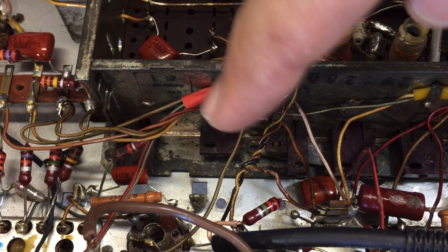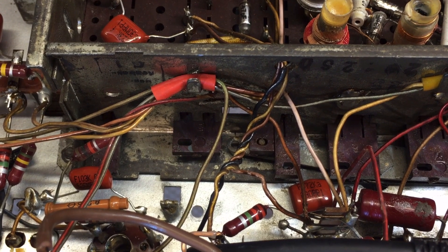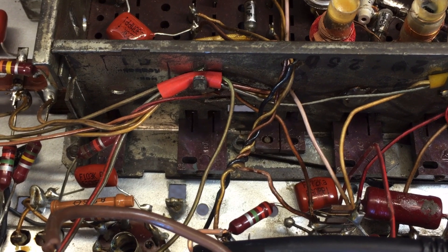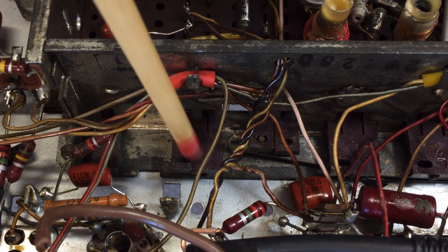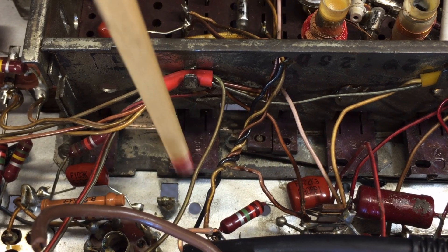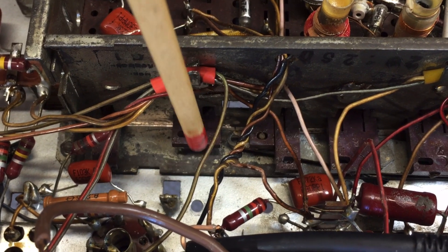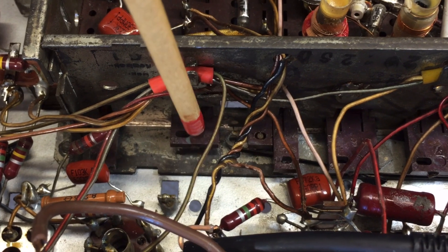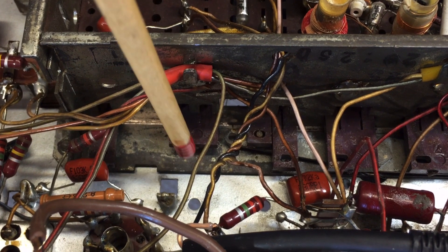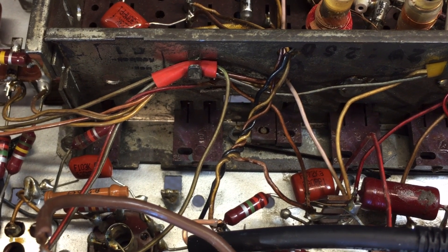If we look at the switching that happens at the back of the switch assembly, you'll notice something interesting. I've got the pickup selected and I deselect — select, deselect. Now if you look carefully, you see that guy over there? Well that guy goes in and out quite a bit. It goes in and out about one centimeter when you select it. They all do, but I'm interested in this one. When I select pickup, that thing goes back one centimeter. When I deselect it, it comes out. So I figured, well what about putting a little micro switch in here?